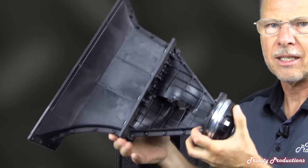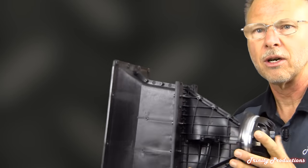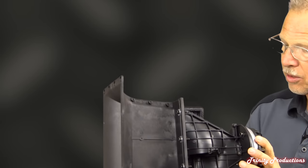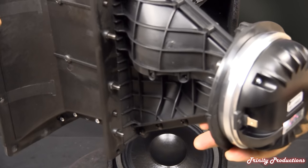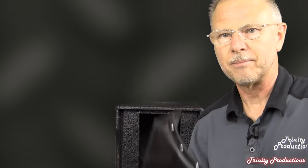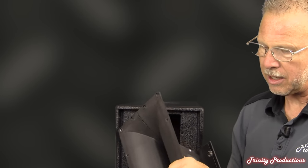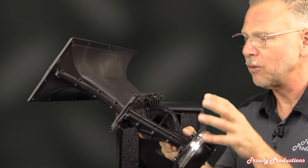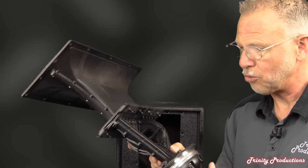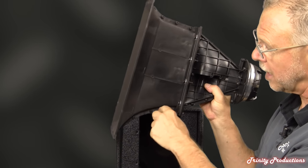So we've got the horn assembly out. This is the cellular horn driver for the box, similar in waveguide design to what they've done with the HDL 20 — very similar to that. This is well over 12 inches in horn assembly diameter. It is all made of injection-molded plastic for the waveguide assembly. With the offsets you can see, what they've done is work on timing and phase alignment so the driver can splay through the horn assembly.